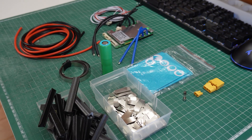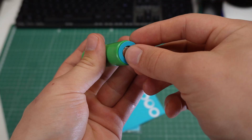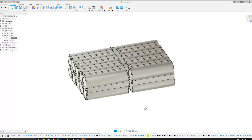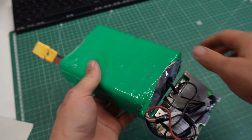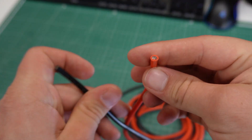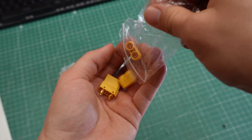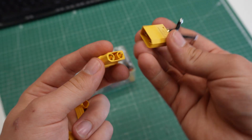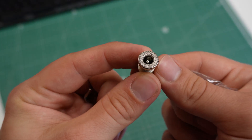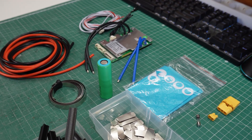With the main things out of the way, let's quickly go over some cheap accessories that will make your life easier. These stickers act as double isolation for the battery terminals and I would definitely recommend you use them since they are super cheap. To keep the cells in place, you can also get some battery spacers, but I designed both of these myself. To cover the battery cells and make it a complete battery pack, you will need some heat shrink - measure your battery to see which size you need. For the main power leads, you will need some high current wire - I will be using some 12 gauge silicone wire. The last piece of the puzzle is your main power connector, which will be used to connect this battery to a load. In my case it's an XT90 connector. I will also be installing a small barrel connector so I can hook it up to my charger. All of the required parts will be linked down below.